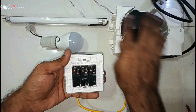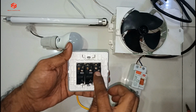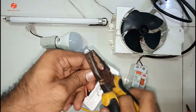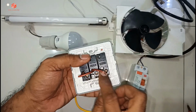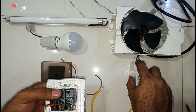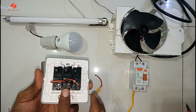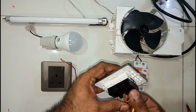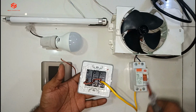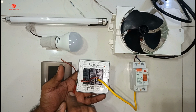After that we put our fan or light, or we have another light we can put depending on our switch. So we do the wiring first, these 3 of this together. So this one loop, line, then incoming from that one, outgoing from the incoming is here, main supply is in the board, and then after that the one supply wire comes into your board. So that supply is straight away you give to your switches. So we give ready the supply to all the switches. You can see the output from here, then come here, then we divide to all the switch, 3 switch.